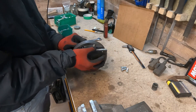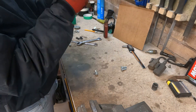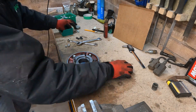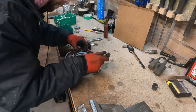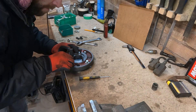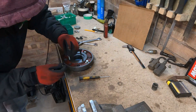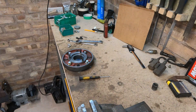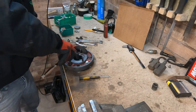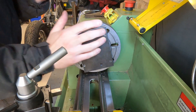Using the faceplate with the lathe for the first time was a learning experience, particularly when it comes to mounting the work to the actual faceplate itself. The faceplate is very small when it comes to mounting parts or components to it, particularly access to the back of it. The casting is not that great either. I did have some issues with washers getting jammed up, not enough clearance, and generally just a bit of a pain.